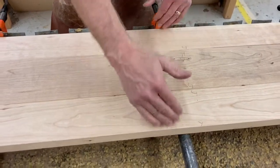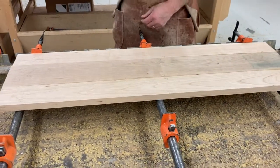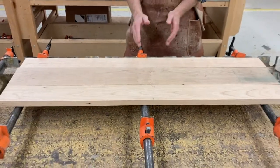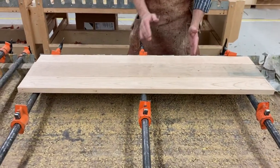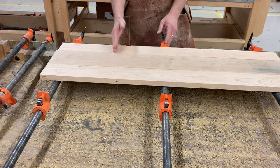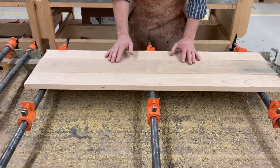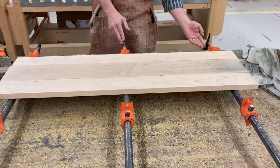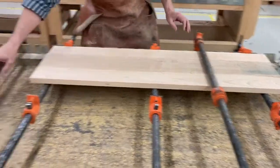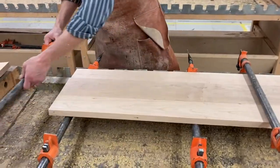First I'm going to glue this one, then I'll glue that one. I'm going to do a dry fit. I want to clamp at least approximately every other space — notice there's an extra space here and there, that's okay. I want to get at least five clamps on each of these panels, and I'm going to alternate whether they're underneath or over the top.